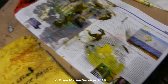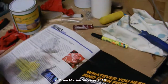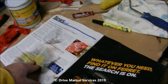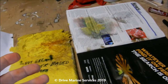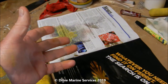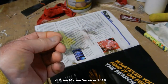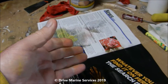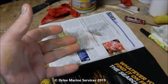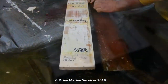For disposing your scrapings, just open an old magazine, spin over a couple of pages, and then dispose of it in your garbage. Basically with Lemon Peel, what makes it toxic is what you take off — the stripper itself is reasonably safe in its own right. Don't use it with bare hands; it will de-fat your skin, but it'll take a while and it doesn't bite like the paint strippers you buy at the local hardware store. Extremely easy and extremely safe to use.